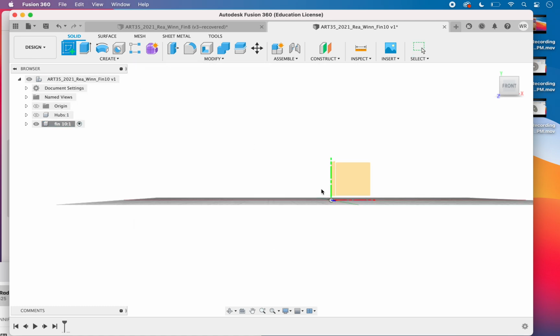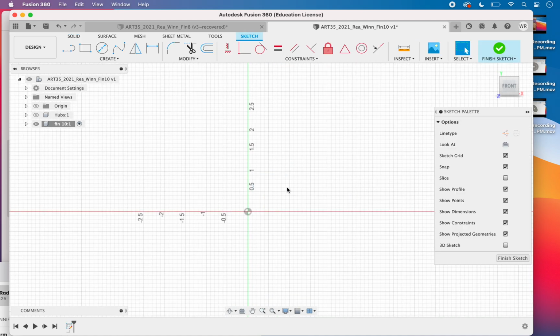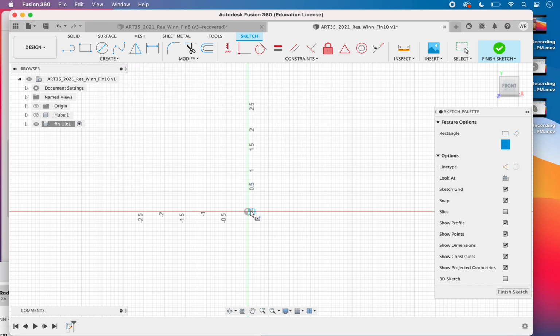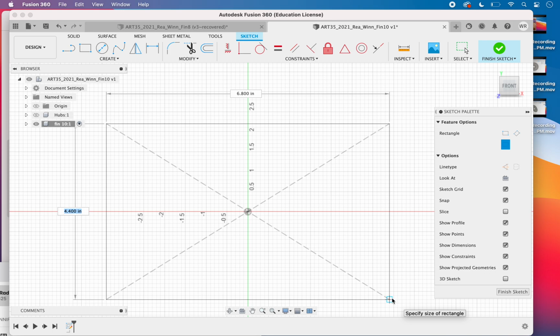create sketch. Once again, we're confirming that we're on the front. I kind of anticipated that's what I want because that's where we were just doing the hubs. So I will accept that. And now we need to start by creating ourselves that safe space to work within. And the reason we draw this rectangle, the center rectangle, is we're trying to give us our sense of the amount of space that we're going to have in the laser cutter to actually cut.